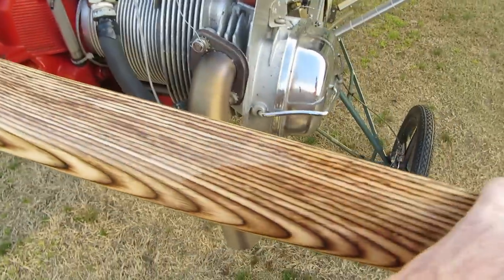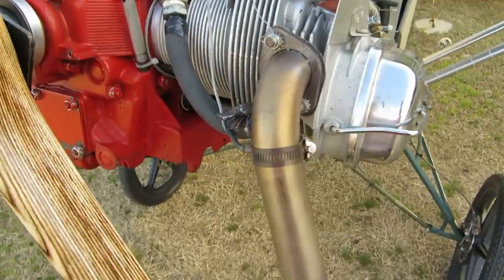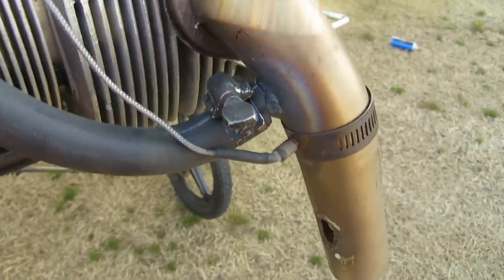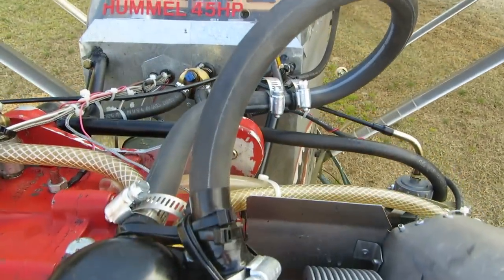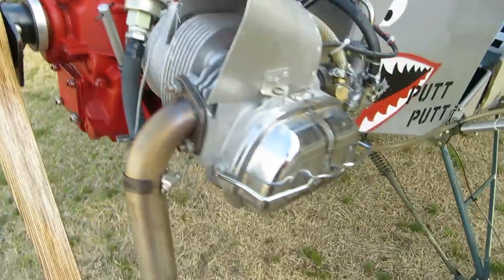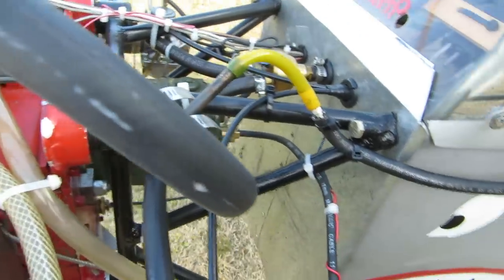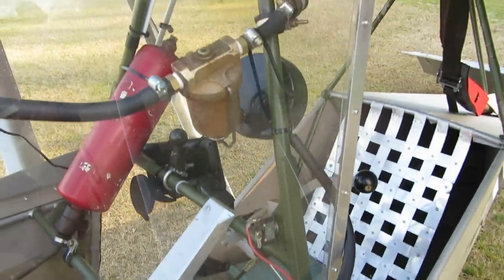Here's a stainless stack that Steve Kilminger sent me, with a little port welded in it — one of his brain-childs. I think Severidge has got one of these on his too. This line goes to the crankcase; the idea is to put a little suction on that case, lower the pressure in there, and maybe get a few more RPM. Here's a gauge line going to the suction gauge in the cockpit so we can read crankcase pressure, or at least breather line pressure.